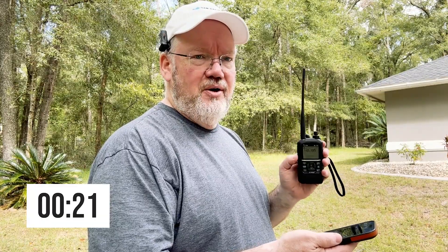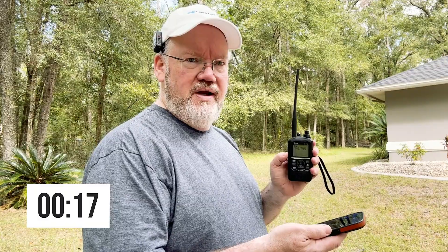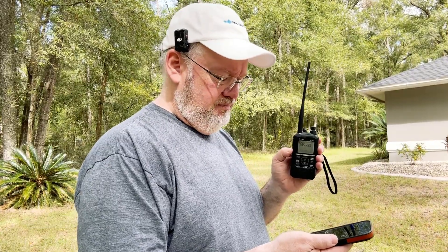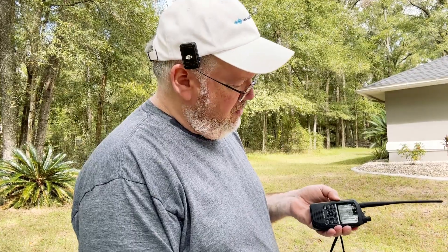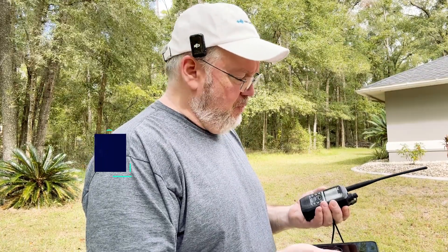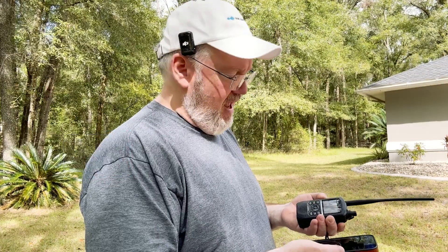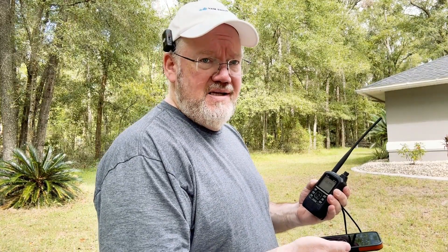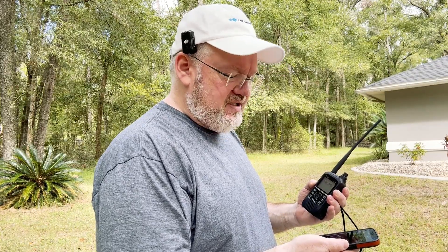It should start transmitting again in about 30 seconds. We'll open up the squelch to capture even the little bits of audio we can. We're at 21 degrees elevation now, dropping to 20 degrees — anything after here will be a challenge especially given trees in my location. There it goes. Horizontal orientation seems a little better right now. I'm only getting one bar — 14 degrees elevation. You can hear the noise picking up. It came back a little. Could very well be trees blocking the signal.